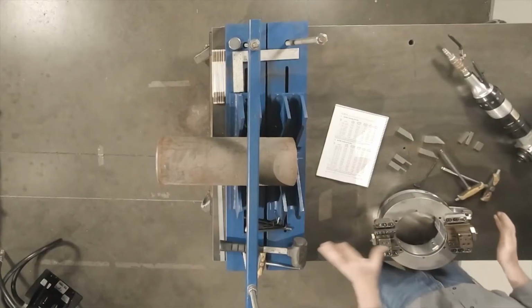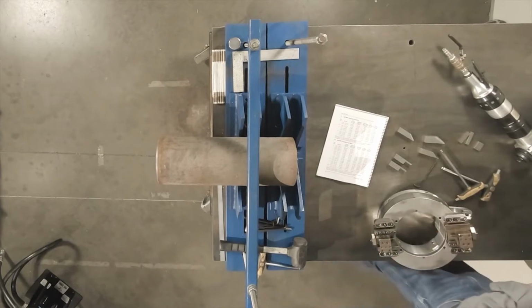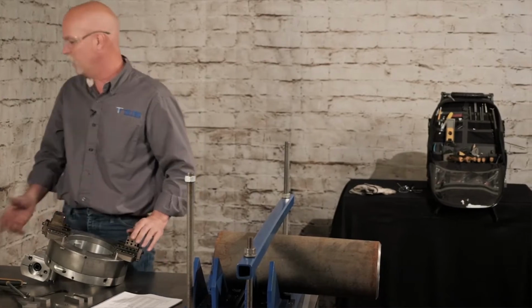So I'm just going to slide it over the end of the pipe, but you could open it up like it was before, put it on a solid run or in between valves. Another thing to mention is this machine has 3 different block sizes it could have. The number 1, number 2, and number 3. And if you had radial clearance problems where you couldn't have anything protruding the machine, you'd want the low profile ones, the number 1s. If you want the full range of how much you can get for lower pipe sizes, you would want the larger ones.